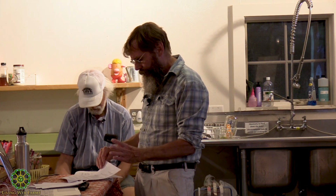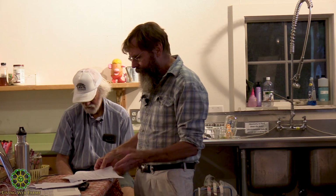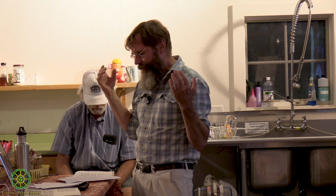Let me see. We already talked about filtration and all that. The only thing left in the handout, which is basically what I went through, is this. The lamps require about 4 cubic feet per hour. The stoves are somewhere from 5 to 15. 700 liters of gas is going to be about 14,600 or 15,000 BTU. 35 cubic feet of gas is 700 liters, which is what the tank is.